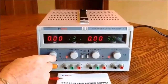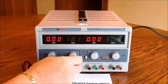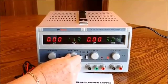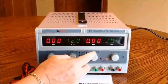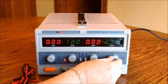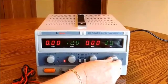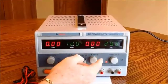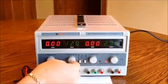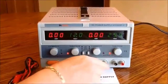You can take this master channel and the slave channel and adjust how you use them. You can use them independently as two different sources — for example, I can adjust one of them to 12 volts, then take the other one and set it for 30 volts. Once that's done I can power two devices at two different currents, or one device that requires two different currents. I can also adjust the current output and voltage output of each independently.